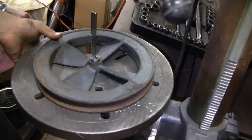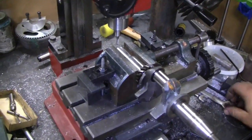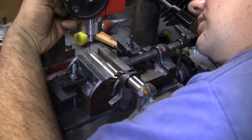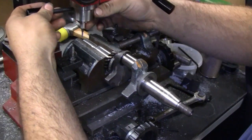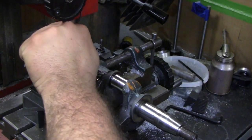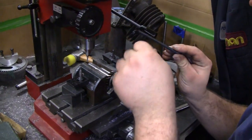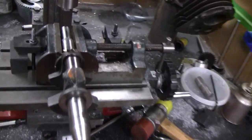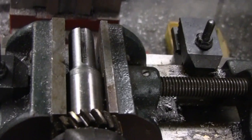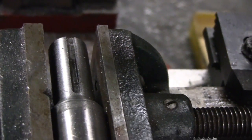I'm going to press it a little bit, then let Mike finish and we'll show you when it's done. Mike's cutting the keyway — well, not anymore. We ran into a little problem: we didn't have the right three sixteenths keyway cutter and tried doing it with a regular tool bit and milling cutter, so it didn't work out. Mike is going to take it home — he's got a three sixteenths at home.